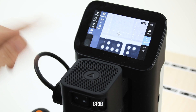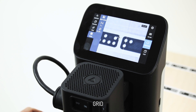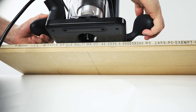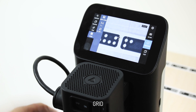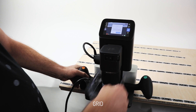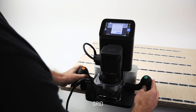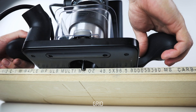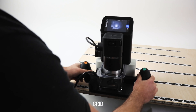We've added some tune-ups to the grid. You'll notice the ability to change our cutter diameter here, so we don't have to reference another menu off-screen. We also have the ability to control the height of the cutter with manual input, so instead of having to do a touch-off after flipping an engraving cutter, we can define a depth and plunge to that depth by eye in a more natural, intuitive fashion. Green is lower, orange is raised — just look at where the actual tip of your cutter is. Once you're happy, go set the probe depth, then touch against the edge to probe the X-axis, hit the green button twice, do the Y-axis, and you'll get a clean accurate one-inch grid to place shapes accurately aligned to the edge of your panel.